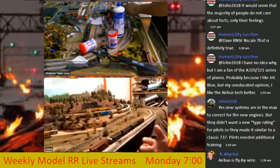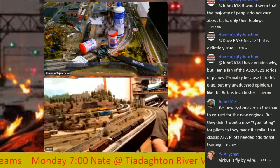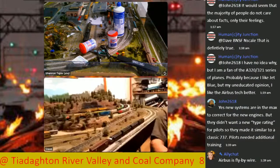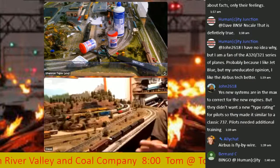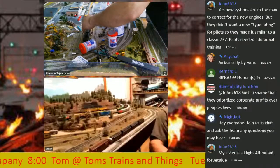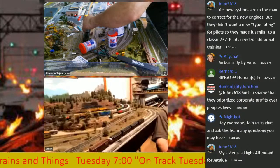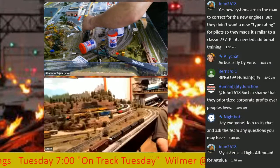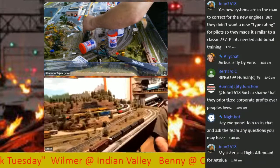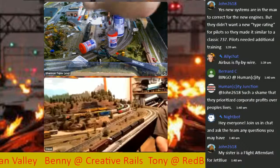let's say a normal 89-foot piggyback car with two containers on it, a conventional two-container piggyback car, you've got one set of brakes for each container. You've got two trucks on the car, two containers. While the articulated well cars cut that in half: you've got two containers on one truck. And then the articulates, it's even less again. So you've got fewer brake shoes for the weight, and those trains were difficult to stop in a hurry.